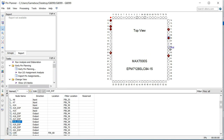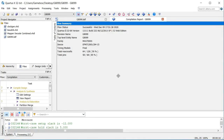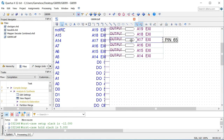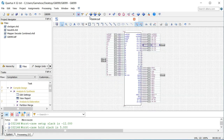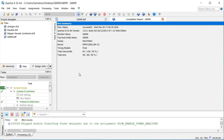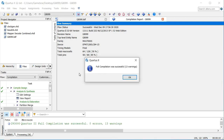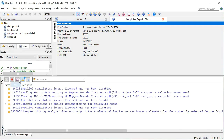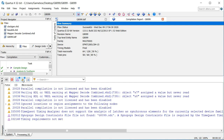Once you're done, close out of this and go back here. It's going to show you, for example, that A17 expansion is assigned to pin 65 — no problem. Then you're going to click Compile, and it's going to run through the compilation again, telling you this time how many pins you've assigned and how many macro cells — the difference being it's now compiling the code so those pins are assigned to a particular physical pin. This time we got 13 warnings — it doesn't look like anything broke the system. And that is it. We are done as far as how to actually build up this CPLD.